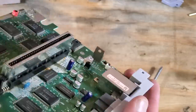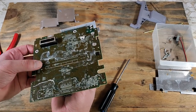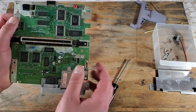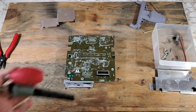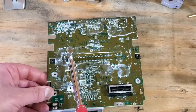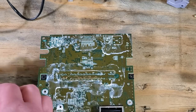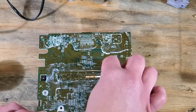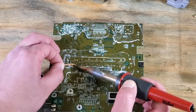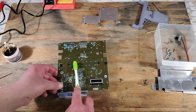They replaced the thermal compound. This isn't the version of the SNES that has the removable 62-pin connector, and this is where my plan starts to fall apart. Maybe it was the fact that I was itching to try out this new desoldering iron, but I wanted to get that connector out to make sure the damage wasn't too bad. I need more practice with that new tool, so I decided to desolder the way I've done it numerous times before — with flux and desoldering wire. I'll admit I spent the next couple of hours trying to get all of those pins free. Sadly, I admit defeat. So I'll hope the damage isn't bad under that connector and get back to cleaning.